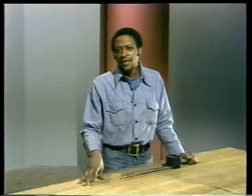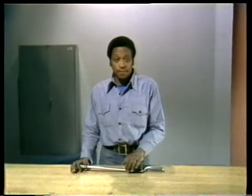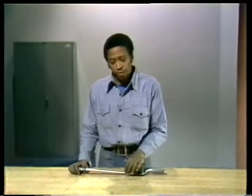Don't just rely on your memory. Try to get a sense of how things sound and smell and feel. Then you'll develop diagnostic skills that'll give you the edge you need to be a first-rate mechanic. There are three major indications of how a bearing's doing: temperature, vibration, and noise. These can tell you that it's okay or that something's wrong before you take it apart. But you can't use the indicators to tell you what's wrong unless you know what to expect under normal circumstances.